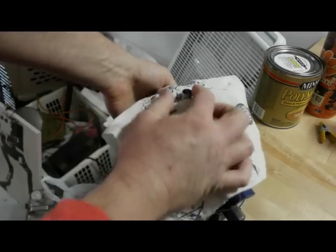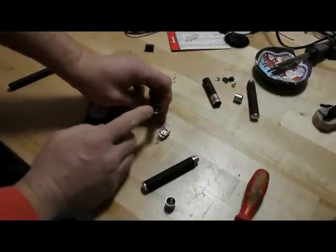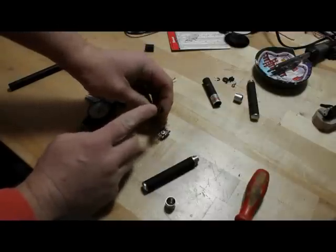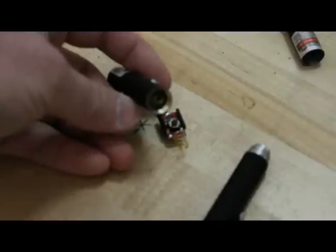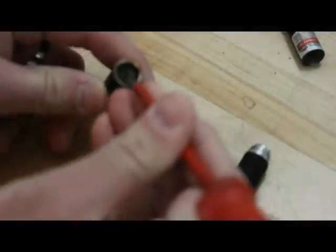That's one way to get that loose. If you look closely at the way this is made, you'll notice this side here has some threads on it, so it's going to be a little bit narrower than the other side. So if you're going to push it out, most likely you'll have to go through that side. There's actually some rubber around the edges here, so you'll probably want to pick that out with a screwdriver.